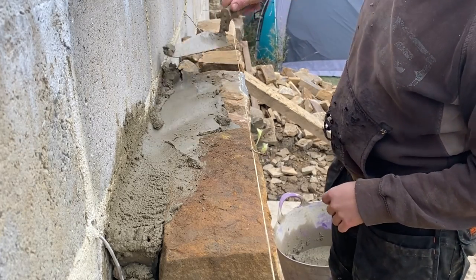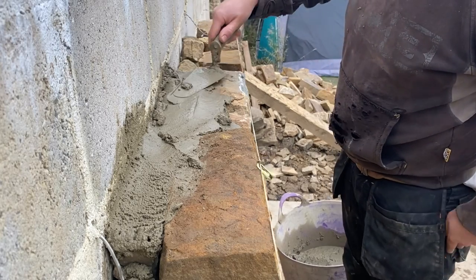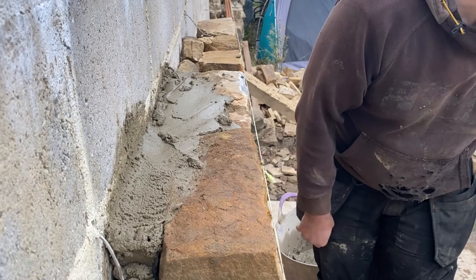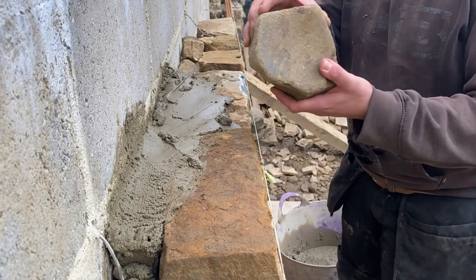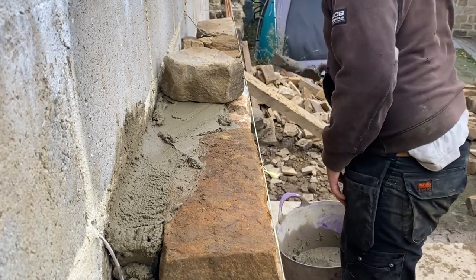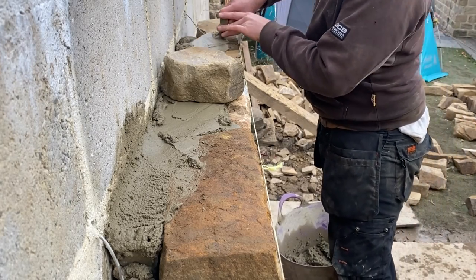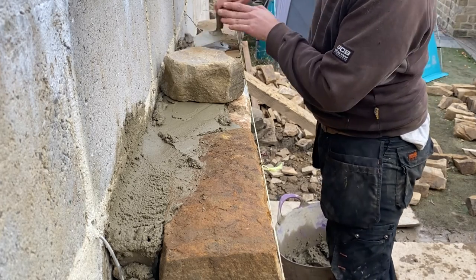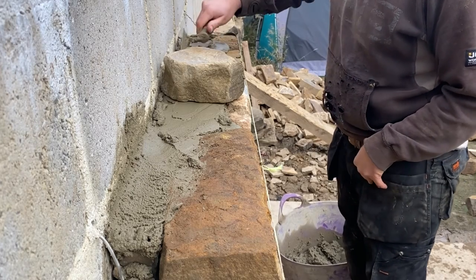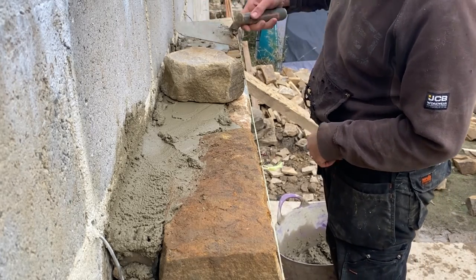You can see that's going to have a really nice bond to keep that wall tie in there. Because it keeps wanting to pop out, I'm going to get a nice piece of stone and just rest it on there so it can be lifted off tomorrow once everything has set, and then another stone will go straight on to replace it. Other than that, nicely backfilling all your joints, making sure it's all nicely filled in and packed in — and that's it, simple as that. Don't over-complicate it; it really is very simple. With the mortar in there you don't have to go the full length with the odd ones — it's pretty good even so.